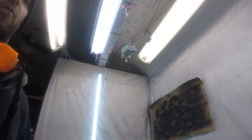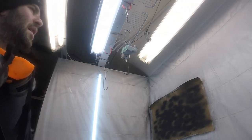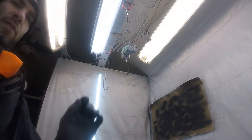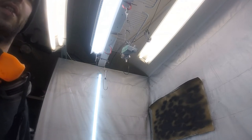Basically, if you want gloss, put Cerakote high gloss clear on it, which they do in oven and air cure. I use the air cure just in case I want to add some gun candy or Warlock custom pigments into it. I tend to find at an 18 to 1 ratio, it's less prone to little surface scratches, even though it won't scratch through. But if you scratch your fingernail on it, at 18 to 1 you're less prone to get that surface scratch. So I stick with 18 to 1.